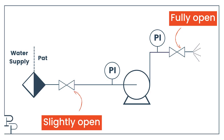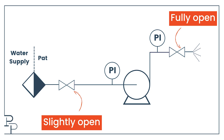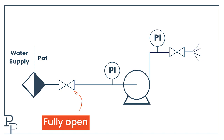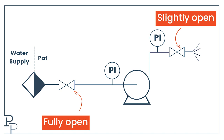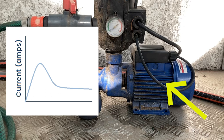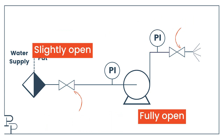The valve positions I have are the exact opposite of how I would normally start the pump. Usually I want as little resistance on the pump suction as possible — this includes when I'm designing suction piping to pumps. That is why using a long suction hose here is really bad form. Long lines, throttled valves, and blocked filters on the suction side of a pump can cause low flow cavitation, which can damage my pump. So I would normally want to start with the supply valve fully open. The reason I want the discharge valve mostly closed when I start the pump is because I still want there to be some flow through the system, but I want that flow to be low — because a motor draws its peak current on startup. The more flow I expect from the pump as soon as I start the motor, the higher that peak will be. This is especially a problem on very large motors where we are concerned about over-current and damage to the motor, so we want to throttle the discharge.